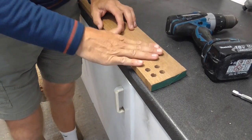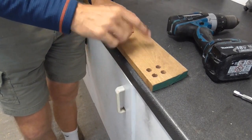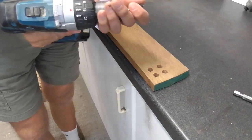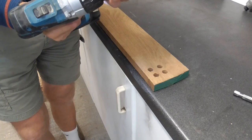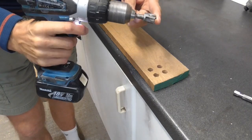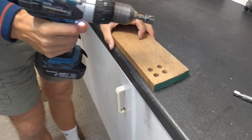What I'm going to show you is how I do it. I see many people who just get their bit of board, put the plug cutter in and then snap them out with a screwdriver. But what that does — it can leave the face of the plug that you end up tapping in jagged, as it's been snapped out. I'll show you that quickly. I've got a bit of oak here with a few holes drilled as a demo.